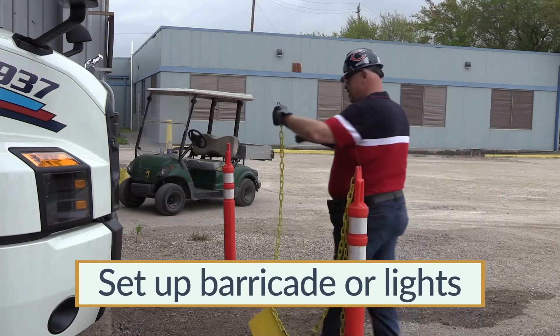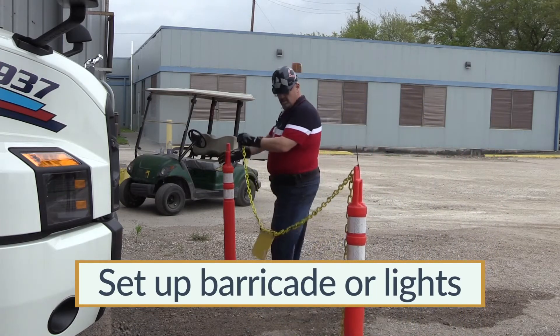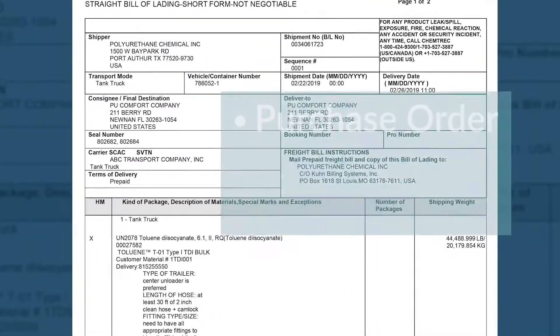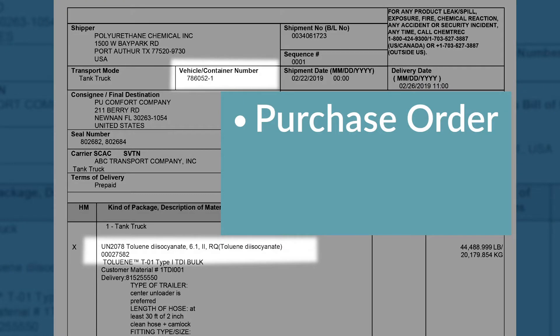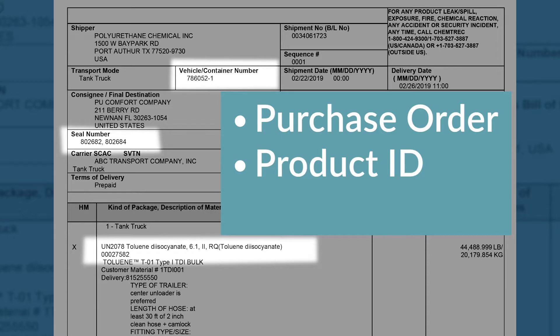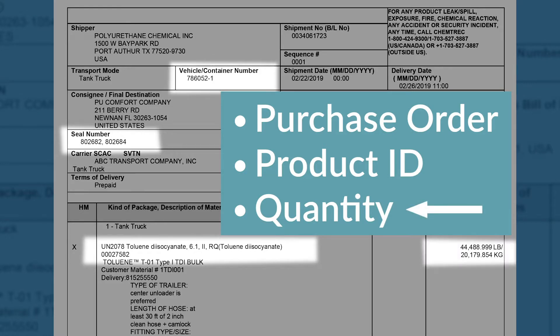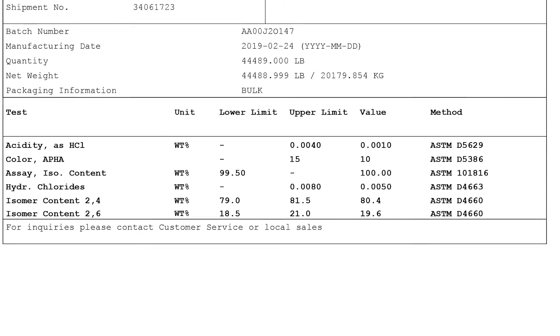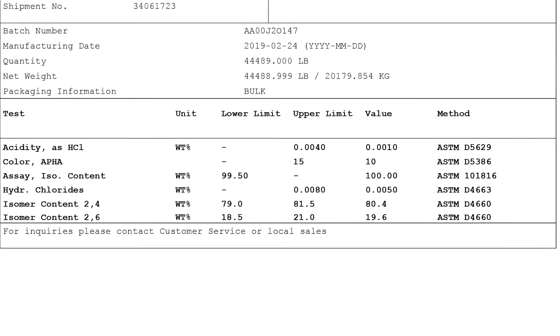As an added precaution, you may wish to put barricades or warning lights around the unloading area. Check all paperwork for accuracy. Verify the driver's paperwork to validate trailer number, product identification tag, and security seals — that the material being received is the correct TDI product, and that the weigh ticket shows the quantity being delivered, to help ensure the volume of the delivery will fit the storage tank.